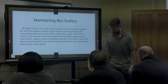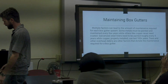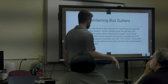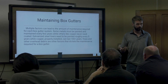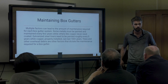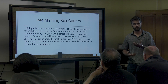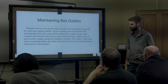As far as maintenance of box gutters goes, you're going to have to paint steel if it's not copper. If you don't paint it, it's going to rust out. That's just nature — oxidation and galvanic reaction. Galvanic reaction is two separate metals touching each other, which accelerates oxidation. Somebody put metal over old liners and it'll rust where those two contact and then rust from the bottom up. It might look fine, but if it's not done right, it's not fine.